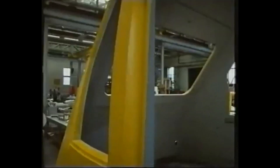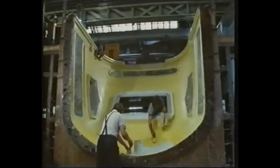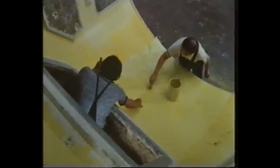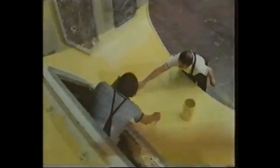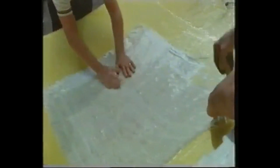The cab has two skins. The outside skin is yellow, the inside grey. The outer skin is made in one piece. Layers of glass fibre are placed one after the other on a mould carved from wood and plywood, then impregnated with a plastic resin especially developed to be as fireproof as possible. The glass fibre is woven in a cross-plied sheet, and these sheets are progressively layered so that the direction of the cross-ply is alternated, giving the outer skin greater resistance to impact damage.